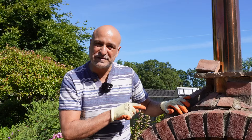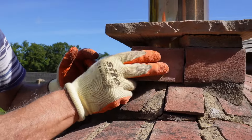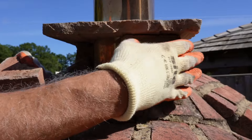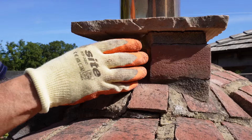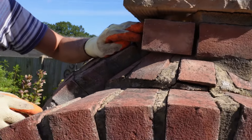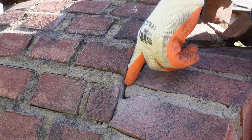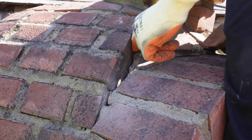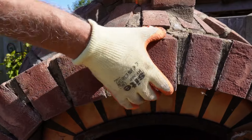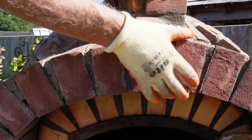I'll show you a little bit about the repairs I'm doing today. For example, this is a brick that was sitting here and has come off because the cement is very loose, so I will be removing all of this today and applying new cement and putting it back in place. Also over here there is a gap that was obviously not there when I made it before, and I want to make sure that is properly repaired. Some of those bricks have come loose over time. I will be replacing the cement to make sure they are steady.